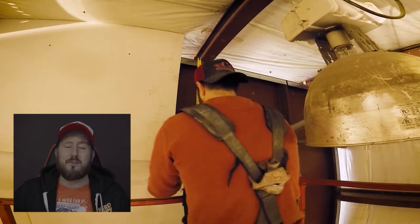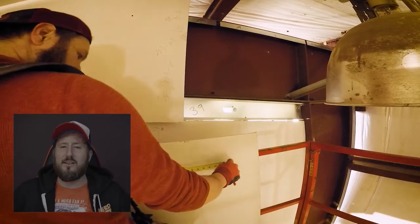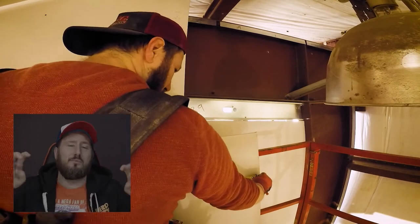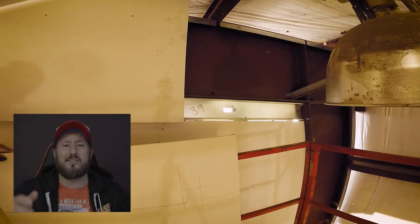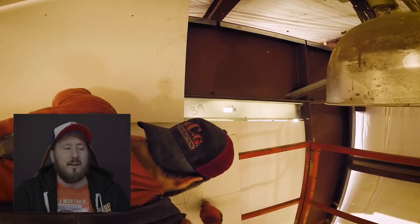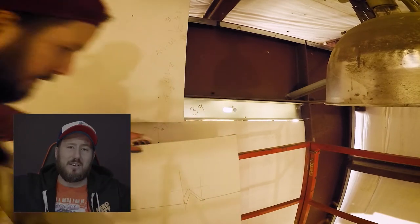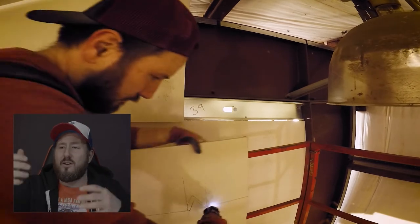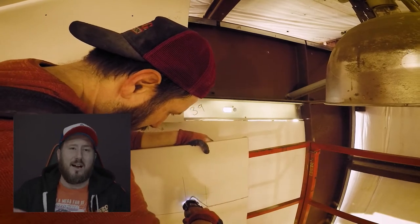You can see here I'm working on tops now — this is the bulkhead. When you're working on a lift, best practice is to do everything you can in that area before moving over. I did it with the steel and now I'm doing it with the drywall. Doing tops is pretty easy — find a gravy piece, which is a sheet with no cutouts in it, put that on, get it square. This is tricky because the ceiling is sloped, but once you get that gravy piece in, you can start doing your other sheets because you have something to take your measurements off for cutouts.